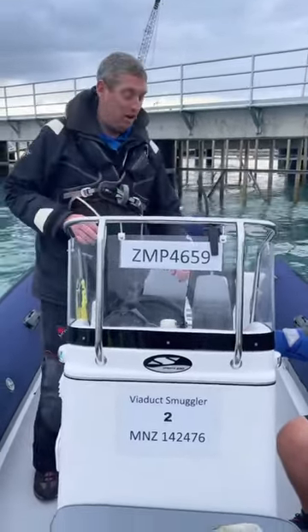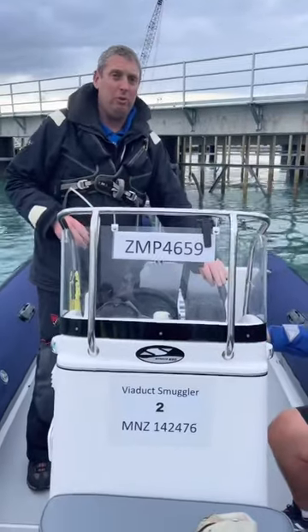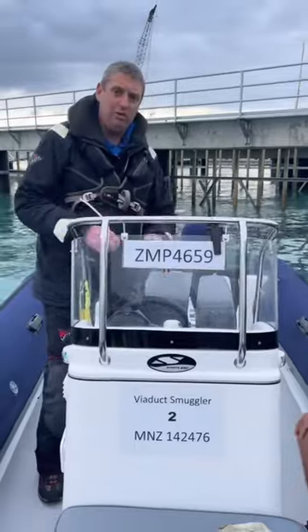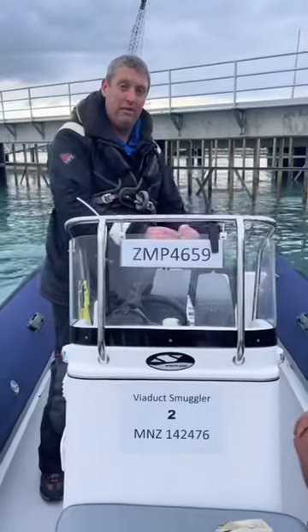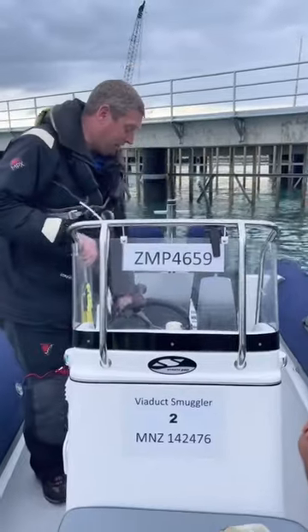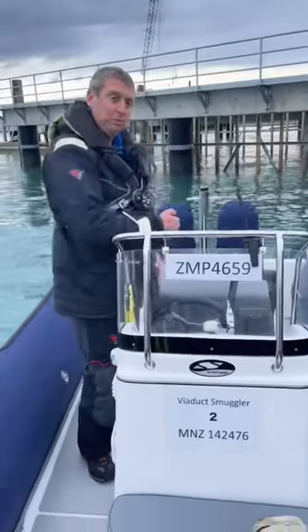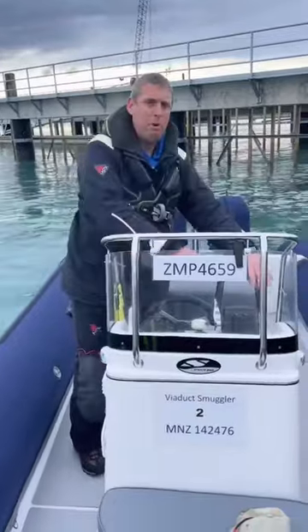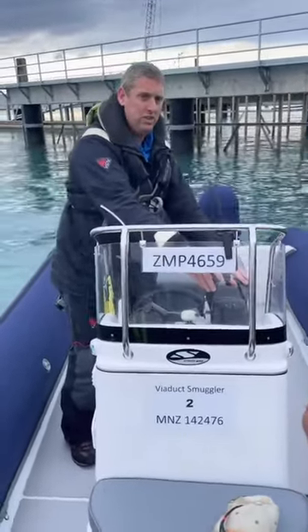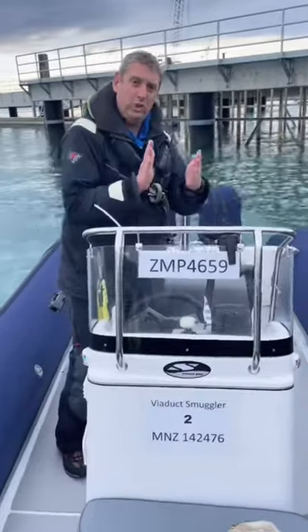You don't have that on a larger motorboat. On larger motorboats which have a rudder and fixed propellers, we generally just leave the rudder in the midships position and do everything on the engines. We can do the same on a rib like this — put the engines in the midships position as you can see here — but we don't actually get great steerage from the engines because they're so close together.